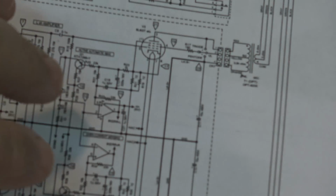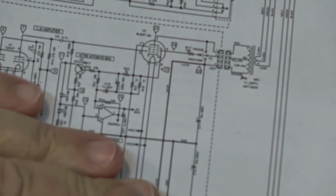There's half a dozen or so different tubes that can be plugged into this amplifier directly, and there's no adjustment required. That is all taken care of by this automatic biasing circuit that's in here. So they have no effect on the actual audio signal at all. These components are strictly to bias the different types of tubes. But it's a very, very basic circuit. There's one tube for the preamp over here, and then one output tube, and it amplifies the entire waveform. Anyway, that's a single tube.